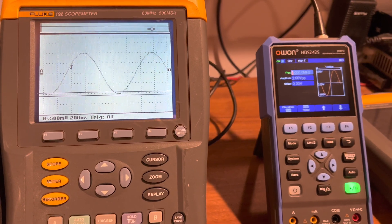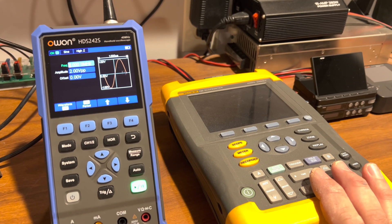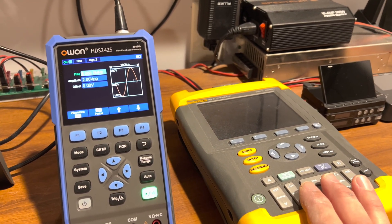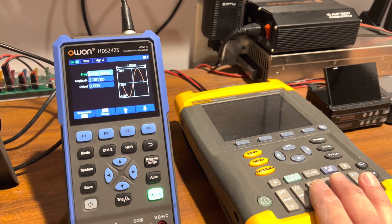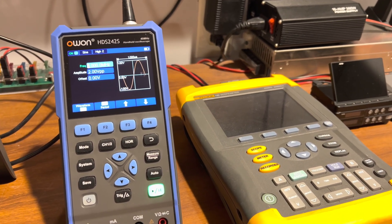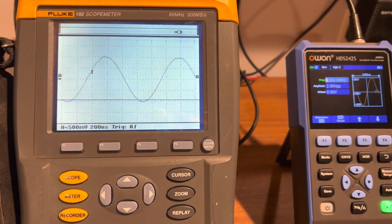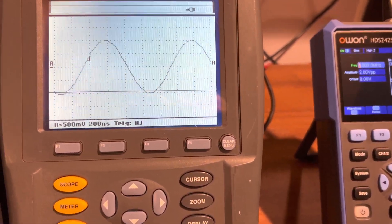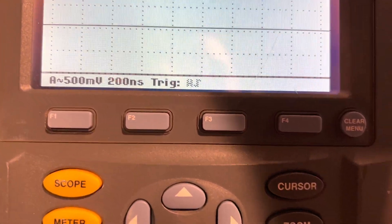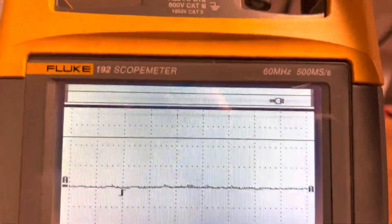It's kind of a bummer because now I have to find an actual donor for this one, or I can just sell this one for parts since both ADCs work. There's nothing wrong with it except the DC jack is broken — if I replace the jack the board will be good. That kind of sucks because I was actually hoping this thing was actually broken. Let me go ahead and show you that both channels are actually working, so let me switch this cable over to channel B.